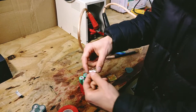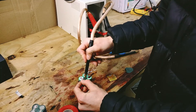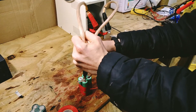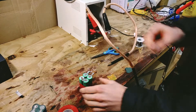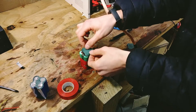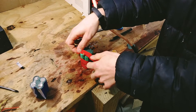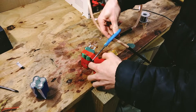I've got to add one of these lengths of nickel here so that this tap can connect to the BMS — it's just a series connection. That'll just fold up and over so it can connect to the BMS. Heavy focus on insulation because these batteries mean business, so make sure you've covered everything as much as you can.